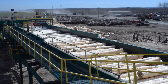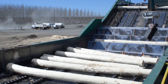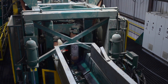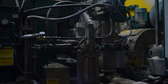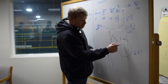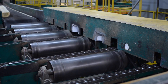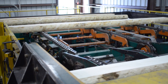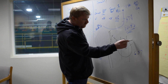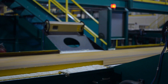Now we're not only doing sawmill blocks, we're doing veneer blocks. But you get one perfect log, all you gotta do is run another one. From there, once we create the block, we bring it in and start breaking down the block into boards — basically cut it up into three pieces. This will be our center cant, and these are flitches.